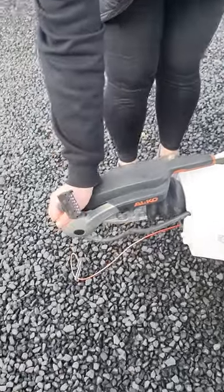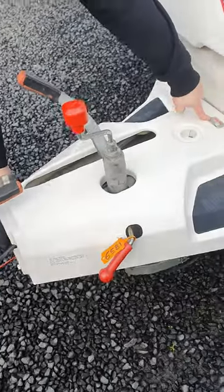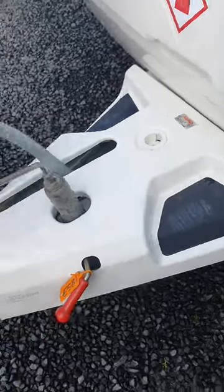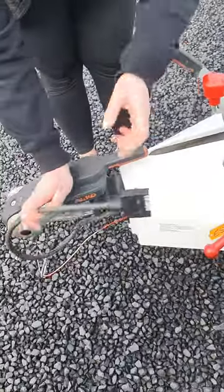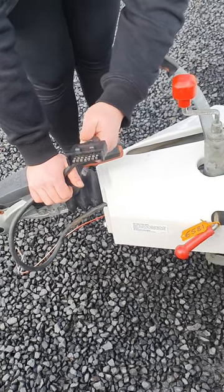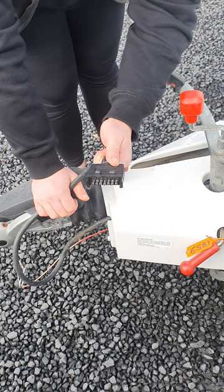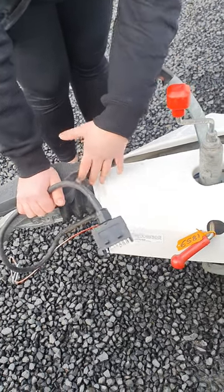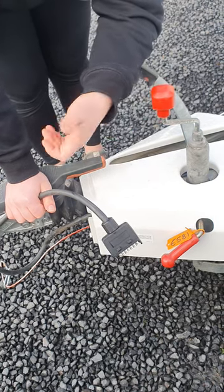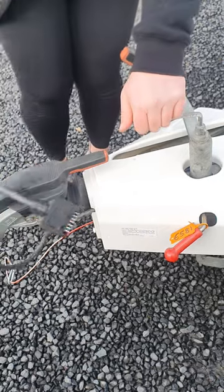You have a 7-pin trailer plug on here. Your van is equipped with ATC — active trailer control. In this cord there are extra wires, so you can have this plug changed into a 12-pin trailer plug. You will need an auto electrician to do that, and they also have to rewire your towing vehicle. This is designed so that if the van ever starts to fishtail, the ATC will sense it and brake each wheel individually to bring the van back into line with your vehicle.